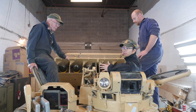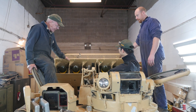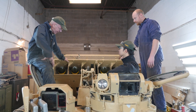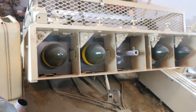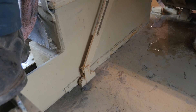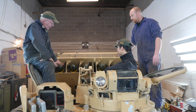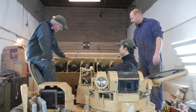We've just been able to raise up the ATGM launcher. It came up easily. There don't appear to be any leaks in the hydraulics, which we expected since the tank was empty. But it worked very well. It's got a relatively small ram that lifts it up to a stop. It's stopped by a bar on the side which also acts as a mechanical lock to stop it coming down if you want to get under there and do some work. We've found the four rockets — not surprisingly, they're dummies, but quite effective.